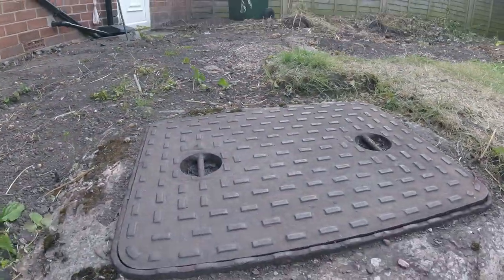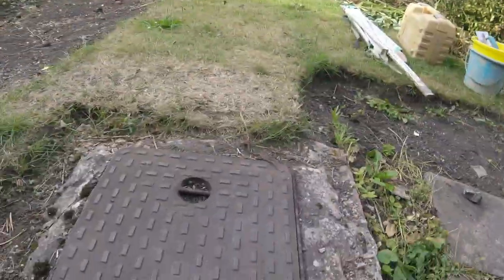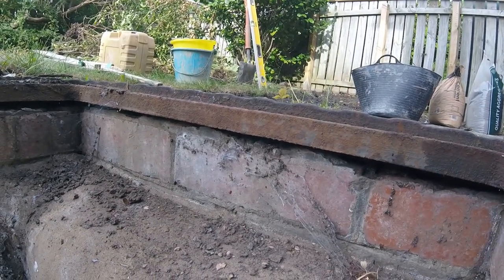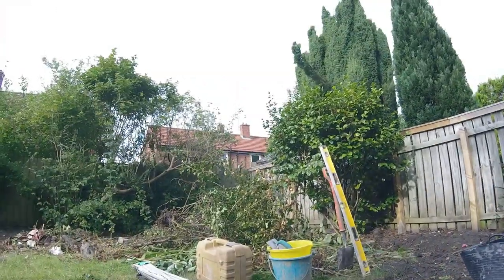So we need to break that one off and set this one on. Which is pretty much going to be: remove these bricks, bed the new manhole cover on, cement it on, so it's nice and secure. I'm going to use my laser.